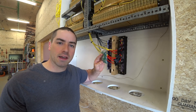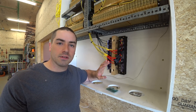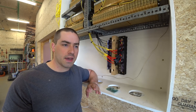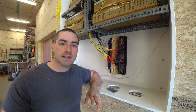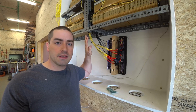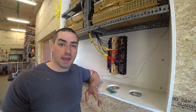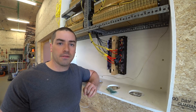I've picked up this pack of 30 amp blade-type fuses and I'm going to put them in the fuse holders. That means every battery maxes out at just a 30 amp draw. A lot of you were concerned I was using too thin a gauge of wire — this is 10 gauge, and my understanding is that 10 gauge maxes out at 30 amps, which is why I picked 30 amp fuses. I have eight separate batteries with 12 cell groups each. That means 8 times 30 — I could draw a maximum of 240 amps. At a nominal 44 volts, that could give me 10.5 kilowatts.